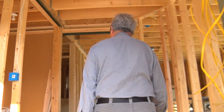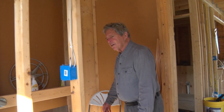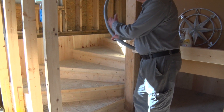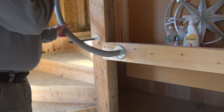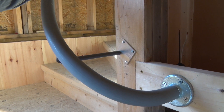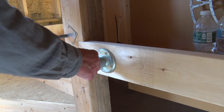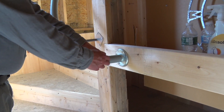We're going in the front door of this house that I'm building. There's going to be an entrance hall here and then a sliding door into the stairwell. There are three flights of stairs and they wind around. I have to give credit to my friend Richard King who designed these stairs. This is the banister that we made — you saw the process. We've added this support since you've seen this, because it was necessary to have something extra in there. Inside this pipe all the way is a flexible metal conduit going around the curve. There's a little short piece down here of straight pipe, and the straight pipe and the flexible metal conduit are attached to each other with an aluminum tube — otherwise when we bent it, it would have gotten a kink right here.